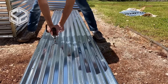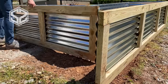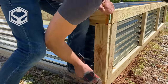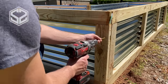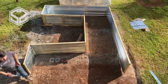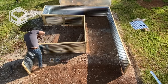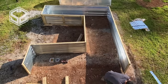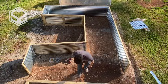I'm also screwing through the vertical sections of the two-by-fours, which really ties everything together and keeps it solid. To cut through the metal you can use many different tools — special metal roofing tools, a sawzall with a metal cutting blade, or an angle grinder with a cutoff blade, which works really well and cuts super fast. If you don't have power tools, tin snips work fine too. On the corners, I use three-inch deck screws straight through the two-by-fours — about four screws per corner.